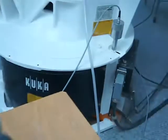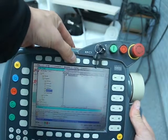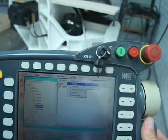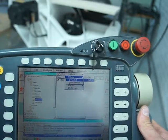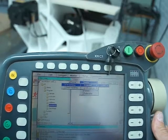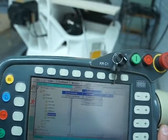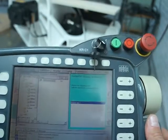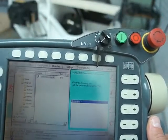Now I go with the console. I go to Setup and I want to master, so I press 1. I want to use the EMT, so I press 1. I want to go standard without any load correction, so I press 0. We can also check mastering if we have a suspicion that the robot is slightly out of calibration — we can say check mastering. But we just need to set mastering. Now we get the list up. I've just unmastered Axis 1, so that's the only one we will master.